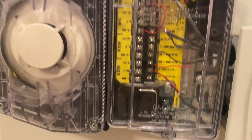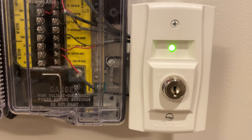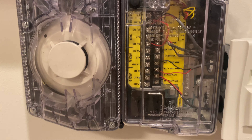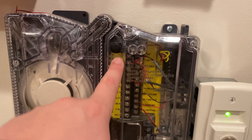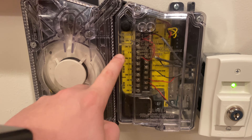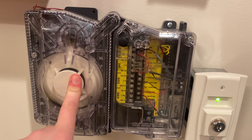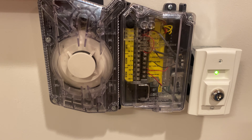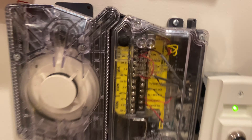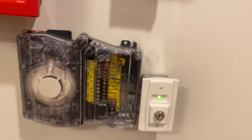As you can see there is a little bit of wiring inside going from this box with the key switch in it. This is taken from the panel's 24-volt power supply, as well as an alarm zone coming off our alarm contact and our supervisory contact. It will put the panel in trouble if you take the cover off, or the head's missing, or the head's dirty. We have a status light up here with some different status indicators.